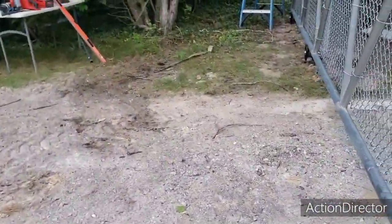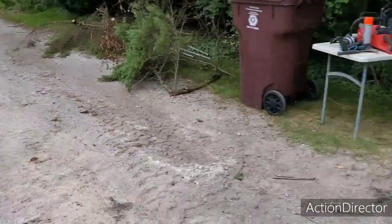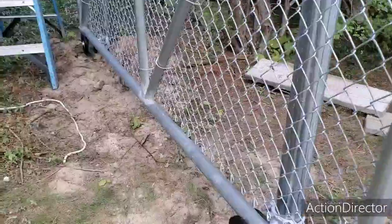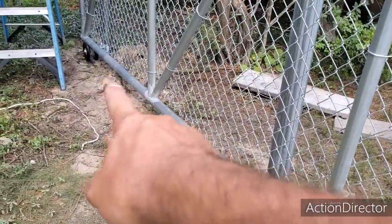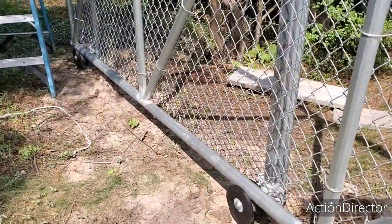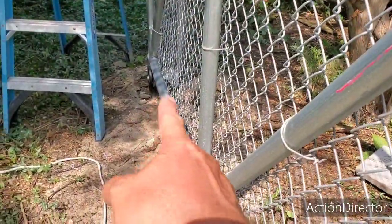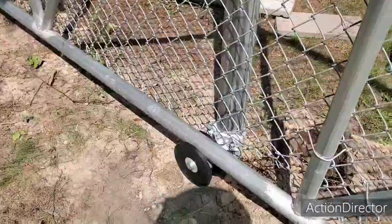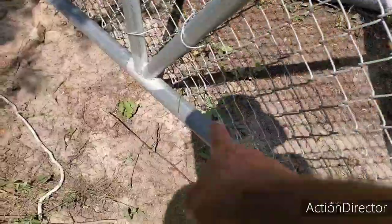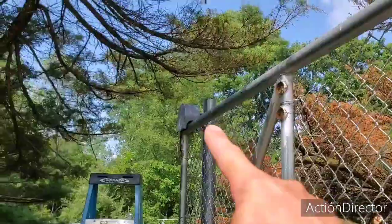The way I started out with this: I had a piece of pipe — right there — and what I did is I laid it across, which you don't have to do it this way, it just saves me time. I put it across just like this pipe is laying here, but not the gate. One thing I'm always checking for is my gaps. I put a level across here and actually made this side a little bit higher because I know I need a little gap up there.